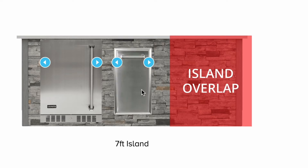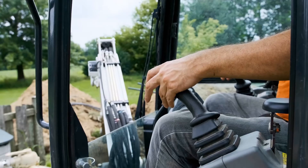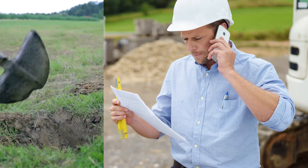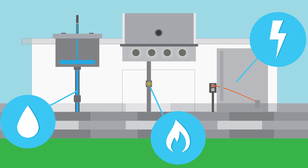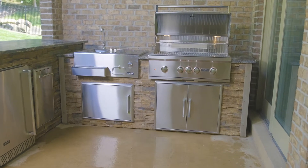There are a few key ways to make sure you can do this effectively. Make sure to plan your outdoor kitchen before your patio gets installed — far too many people wait until after the patio is in place to start planning and designing their outdoor kitchen, in which case it is often too late and requires far more work and money. Have at very least a finalized outdoor kitchen design concept that you can share with your patio contractor. The contractor will need to know which utility lines to run — whether it's gas, water, or electric — and also the layout, so they can place the stubbed-up utility lines inside the footprints of the actual layout. The other factor is appliance placement: your contractor will want to know where the appliances are going to be placed so they can put the utility lines in the appropriate locations.